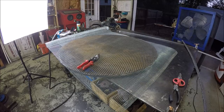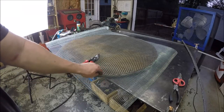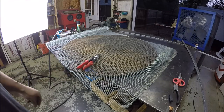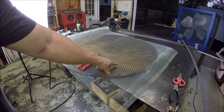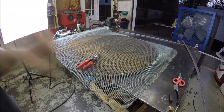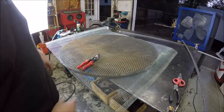This may be a little bit of an overkill, but I picked up some small squared screen. What I'm going to do is cut the circle out and it's going to go in between the round tube that we rolled and this expanded steel. That way it will catch any of the small embers, because I was worried about the holes in this expanded steel — the smallest I could get was the half-inch diamonds. So this should hopefully catch any small flyers.